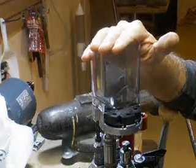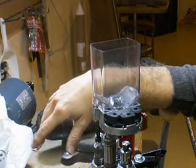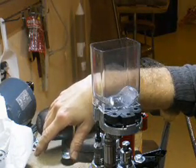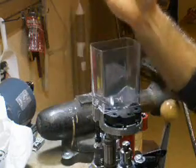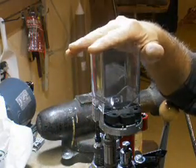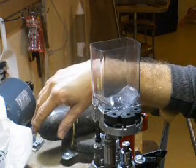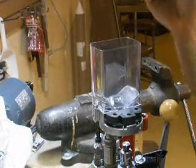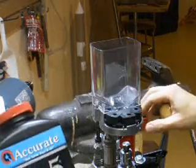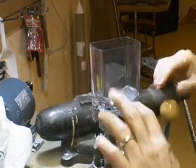First of all, I used the powder measure with double-stacked discs and rifle powder, such as Varget, Hodgdon 322, BLC2, and some others, and they all measured fine. Wasn't a whole lot of leakage. I used Bullseye, not a whole lot of leakage, maybe just a tiny bit. Nitro 100 and Tightgroup. None of those were really much of a problem. Accurate number 5, this stuff is like so fine, so much of a powder, that this was leaking like a sieve. And in fact, it jammed up this.